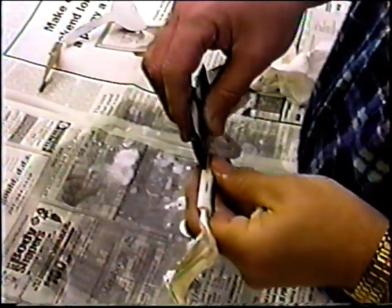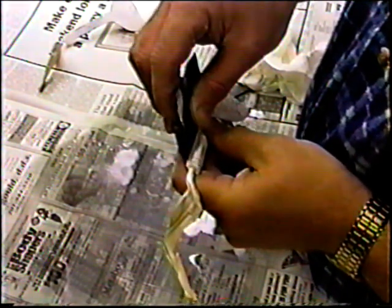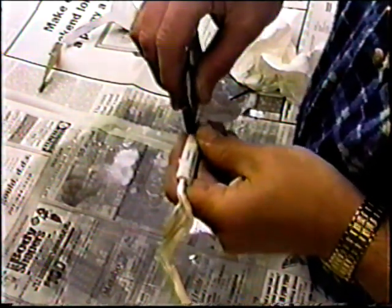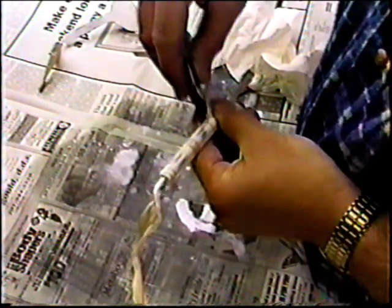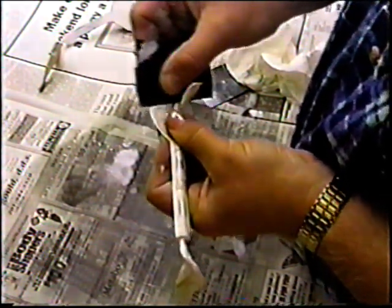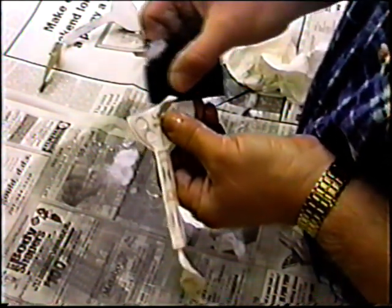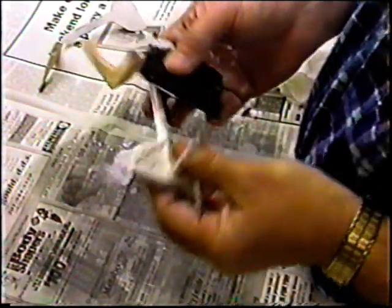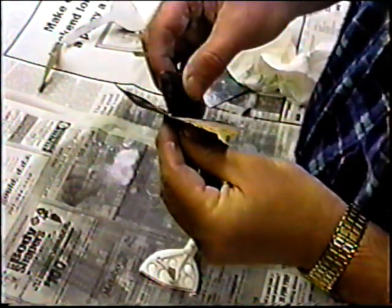Little rubber blocks make a great little tool for getting in all the corners and edges. And of course, what we're really looking to do is highlight all the details in these. Otherwise, it wouldn't pay just to make balsa wood doors or plywood doors. Little details, and these little things are so handy. You can see how quickly that brings up the details. Now, as soon as you wear one corner of it out, you just move the paper up just a little bit.